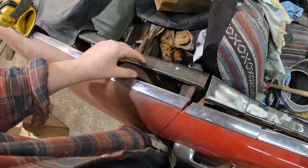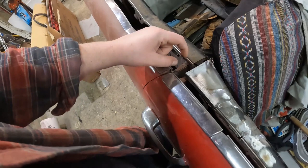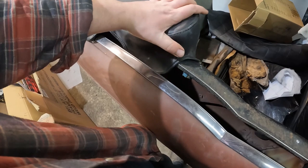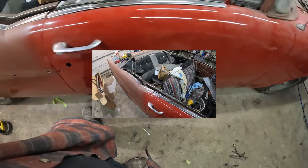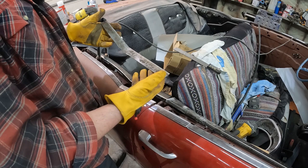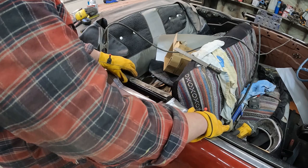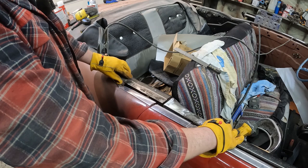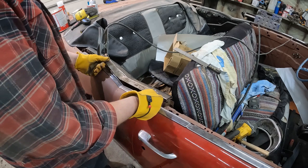Hopefully you guys don't have a better idea that I'm going to waste here. If I widen that, it'll just look a little goofy but it'll look goofy the whole way back. And honestly, that's going to tuck in. This is screwed in, that's where it's going to go. Brainstorming. I'll just measure a piece, get her in there — that'll be easy. I just cut another piece of scrap. I really need to get a shear. What I did was cut this out on a zip disk and put a little bend in it, and then we'll kind of push that down as we weld. So we got the front panel — you've got to kind of hold it where you want it. I think we're just going to give it a couple of welds the whole way across. We'll probably do a little bit of a goofy cut there and then weld another little angle piece on the back for some strength.